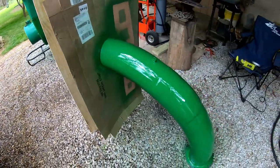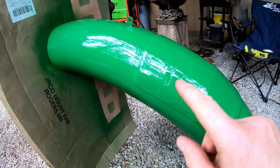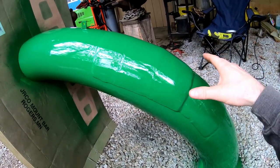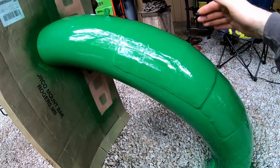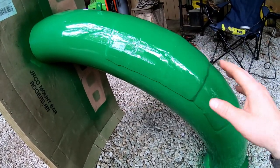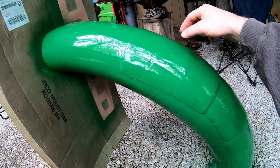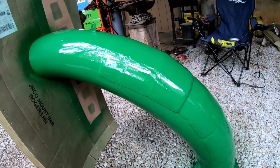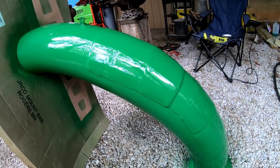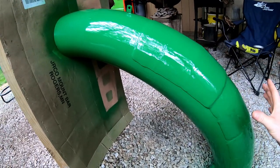The only way to know if it's going to work is to get it on there and try it. If I have any issues I can always add more hinges — I've got room. The other thing I had to do a lot of patching on was this tube. You can see the patch pretty well. At some point this had gotten dropped and it put a big dent in it right here. That dent made a concave area, and debris coming up through here almost immediately started wearing through — there were two or three places through here where there were actually holes worn in it.